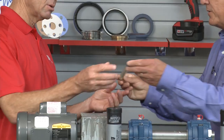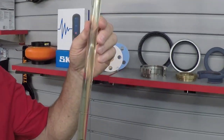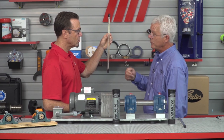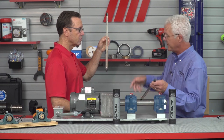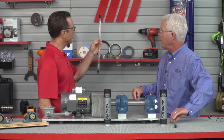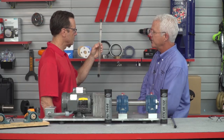These are tubes of oil with steel balls in them, and this represents your bearing roller. The faster your bearing roller goes, the lower the resistance the grease must put on that fast-moving roller. Let me do that again — see how fast that was? It just went flying through there. Yes, that's in the SynGR 132. And here's the oil in the 1444 — a much higher viscosity oil — and you can see the resistance it's putting on that steel ball.